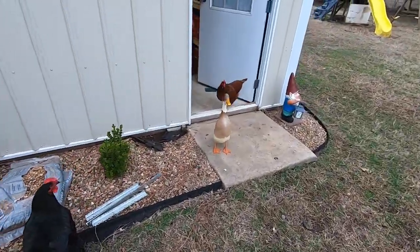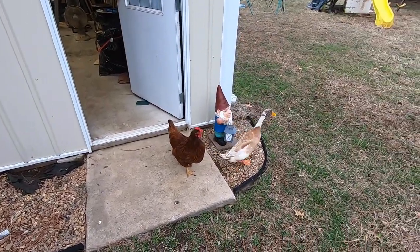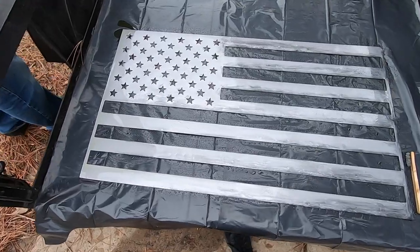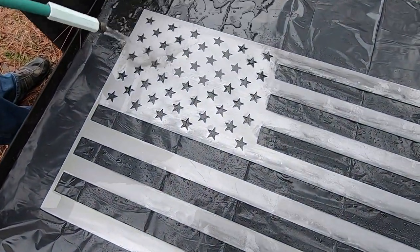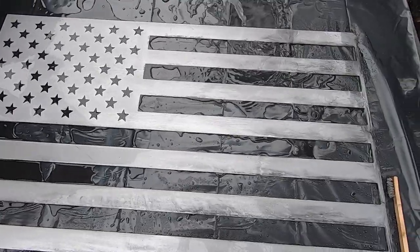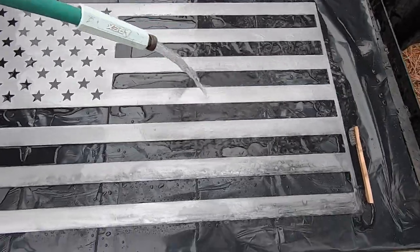Forget about just the one — she recruited the rest of them. We let the acid cook for a little bit, hit it with a wire brush, and now we're going to rinse it off with the hose to see how well it cleans up. That is what steel actually looks like. You're used to seeing it with black on it, but that's just mill scale — that is the color of actual steel right there.